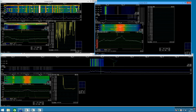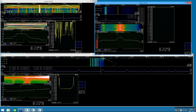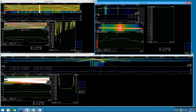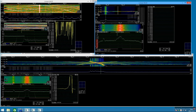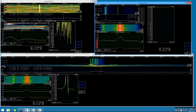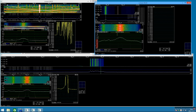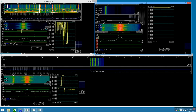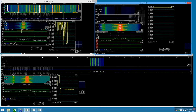So the purpose of this sequence is to give you a feeling for the behavior. I'm not doing precise measurements. I have not yet implemented the filter in the AirSpy, but it should behave in a similar way. The bandwidth is not as narrow as in the SDRplay. I don't remember exactly what it is. You can find the data sheet for the tuner that is being used.